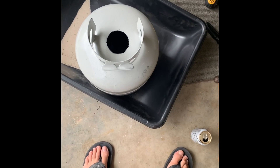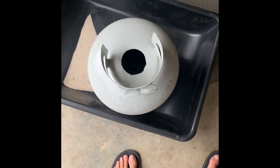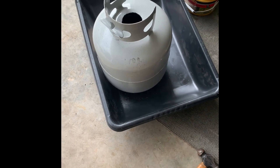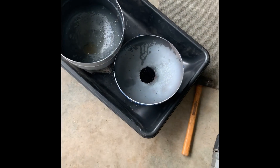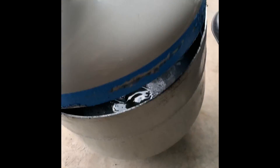This isn't gonna be one of those four-hundred-dollar kilns — it's just gonna be something I made at home that's gonna serve one purpose: melting cans. I made my hole big enough to drop a can right in while it's hot without lifting the lid off. The next step is cutting this thing in half. I got it cut in half — wasn't too hard. Only regret is I was wearing shorts and the little sparks coming off were friggin' hot.